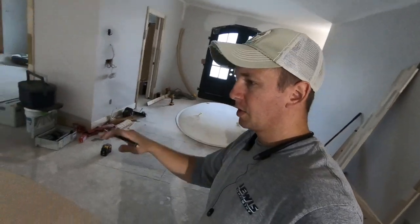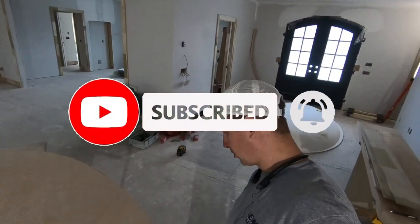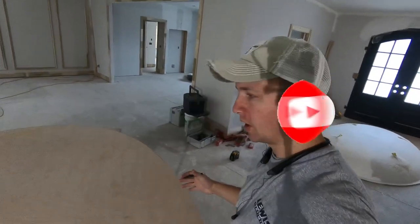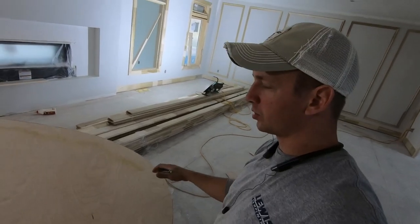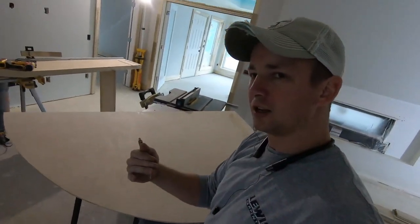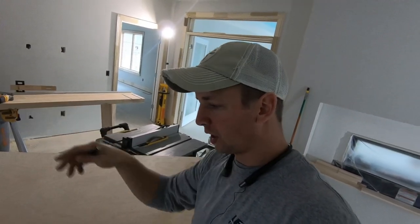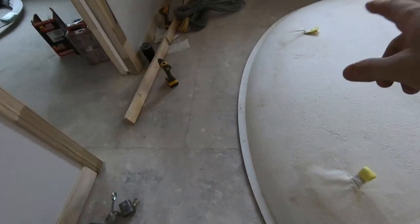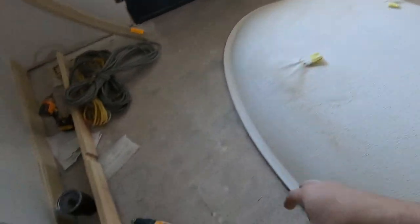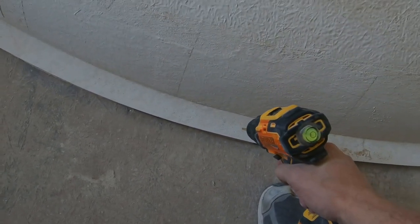Because I'm going to use this same piece for both sides, I'm going to circle the holes on the underside of this plywood so I know which holes are for which side. Now I'll put the template under the other side and drill three other holes so I can align it on that side also. I've got the plywood template positioned exactly where it needs to go, so now I'm going to drill another set of holes.